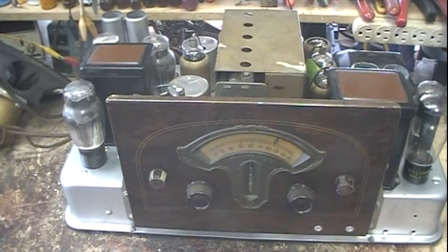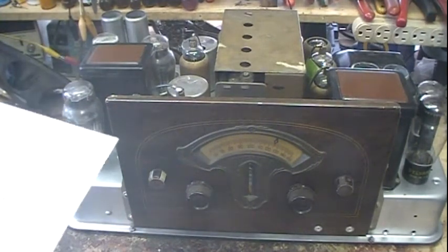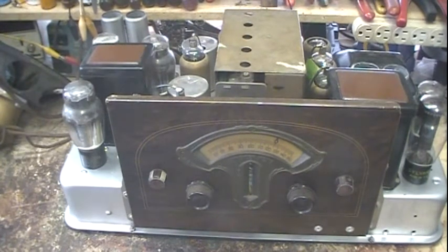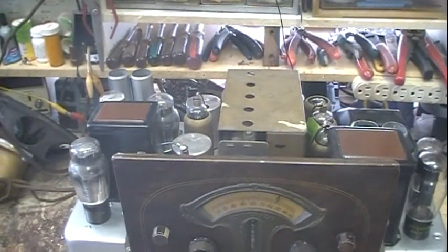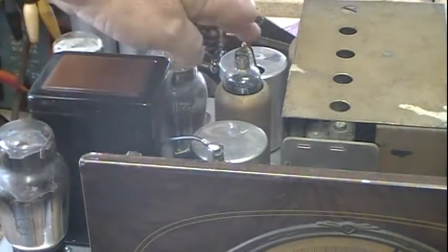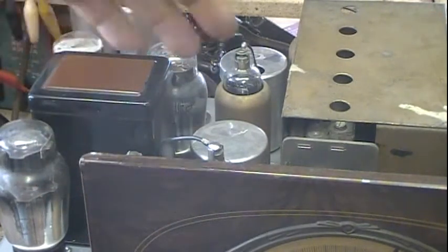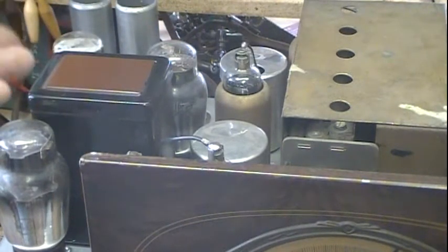Let's go over some of the stuff I ran into. After I got it back together, I turned it on for the first power-up and I had nothing — a little bit of noise out of the speakers, and that was it. The nice thing about radios like this is you can do a real quick test on them by simply touching your grid caps. If you get noise when you touch the grid cap, then you're pretty sure that at least at that point there's a signal getting through — you know the circuitry is trying to operate.